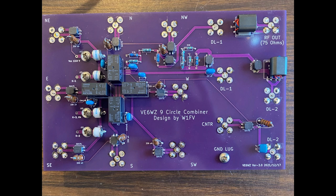Proceed to populate the board with all of the parts — the silkscreen shows all of the values so it's pretty easy to do. Here you can see the gas discharge tubes that I've chosen to install. If you don't want to, just omit them. I lost all the snubber diodes on every one of the four relays one summer — I think I took a ground impulse from a nearby lightning strike, entering via the VCC 12 volt line or one of the control lines — that's why I chose to include these. You'll notice that there are number 8 stainless steel screws here to provide pinouts for both the VCC and the relay control lines, but there are also pinouts for wire connections if you choose to use a terminal strip.